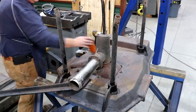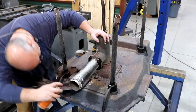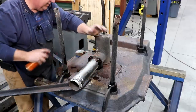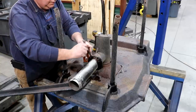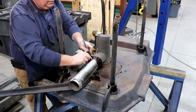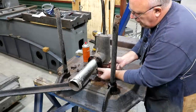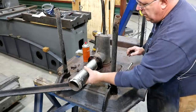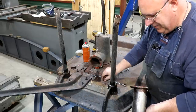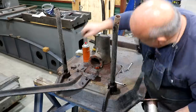Let's see if we can get these screws out — okay, that one is off — and we have the blower off. I'll just set it down out of the way for now. It looks like there's a piece of pipe coming off a flange on the forge pot at the bottom, and originally that would have had a piece of metal piping going all the way to the blower. It looks like that piping had probably rotted out at one time and they just made a flange piece and put a little piece of flexible, thin aluminum flexible piping in there. I'll probably try to fabricate a solid piece of pipe to come in here, make some flanges, and get it back like it was originally. There was some gasket sealer put in there to seal it up — probably not the smartest thing to do on a forge with all this heat, but I guess it worked.